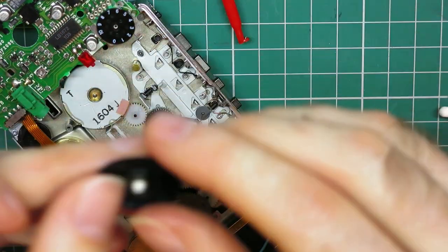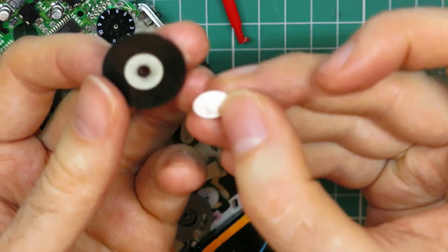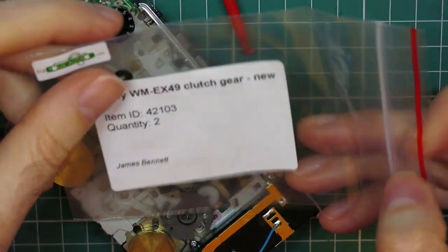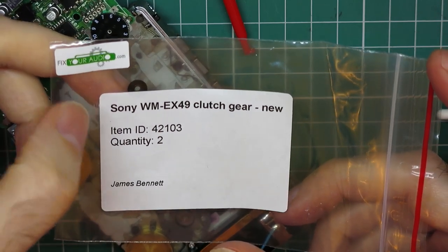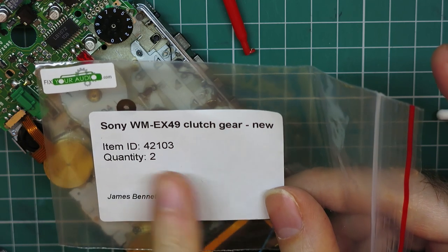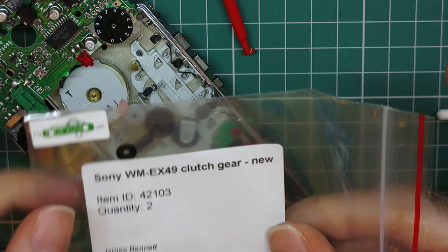So all the parts I'm going to put in the tray there just to show you. There's the felt underneath and the little plate that presses down on it to form the take-up clutch. Here's a replacement clutch gear. This comes from fixyouraudio.com. These are based in Slovakia. Not a sponsor. This is for the EX49. It's exactly the same mechanism. It says EX49 because, yeah, quantity two. So I ordered two of these with a view to do a second Walkman, and this is going to be the one I'm going to do.